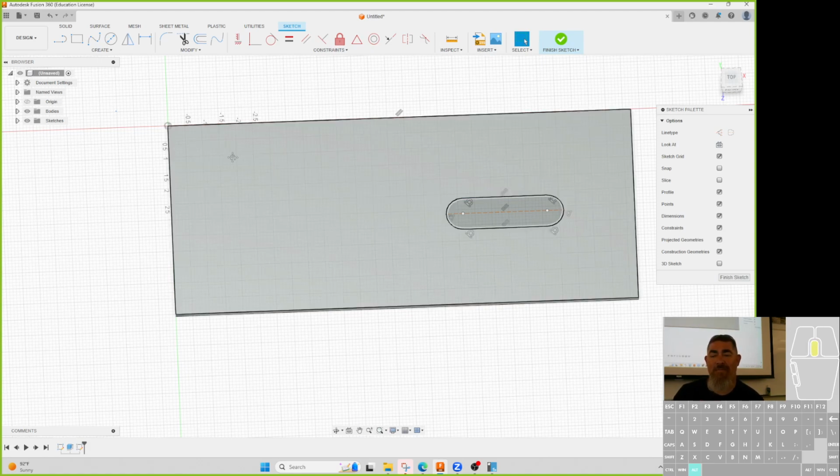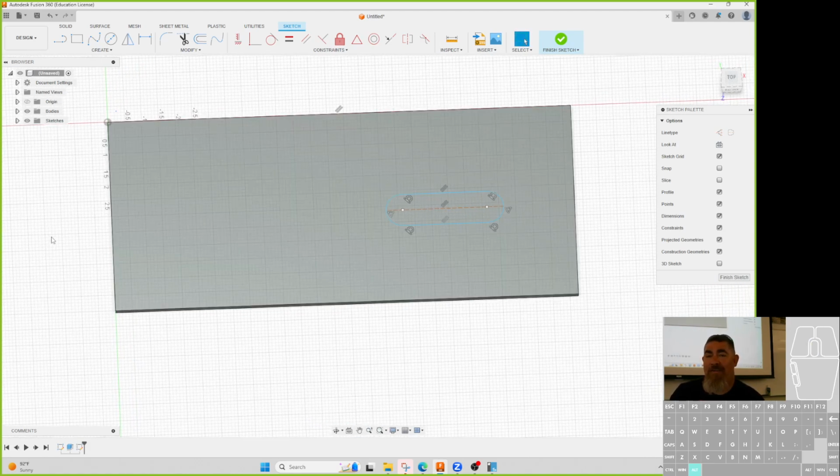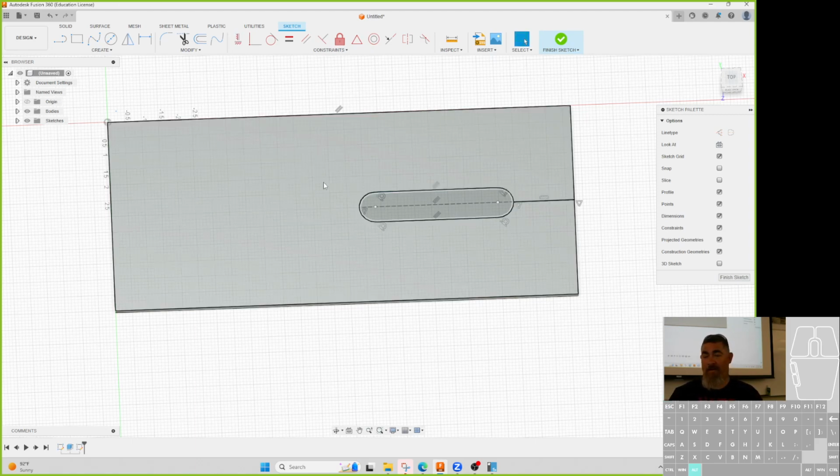Hold on. You define the center line there as a midpoint between the two face edges? You're on the right edge, the right thing. Or the midpoint of that solid line. So I can use the midpoints, right? Yeah. Watch this. I do a line from the end of here to the midpoint. Now I can move this. Those are connected, right? What happens if it's actually in the middle of the part? What happens to that line? It becomes horizontal. Yeah, so I make that line horizontal, it locks in the middle of the part. Now what if I grab this corner?